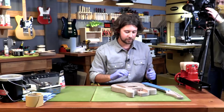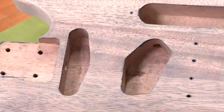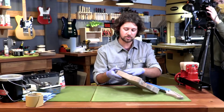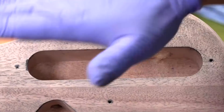Just damp. Correct. And this is kind of your finished product. This is what you're looking for, right? You get this nice kind of almost gray hue to the wood. But once you start putting your color on top, because we're going to dye poly and then stain this, and then we're going to put clear on top of that poly, this grayish, darker hue to the wood will not change a thing. You can see how all the pores are nicely filled. It's very exaggerated, very easy to see. This is what the back will look like, right?